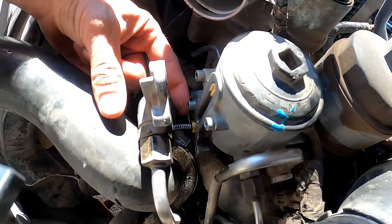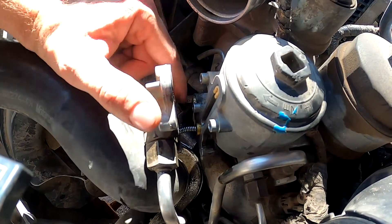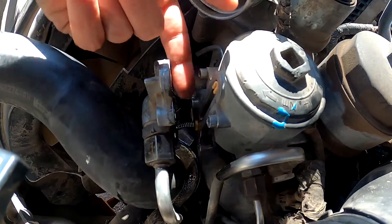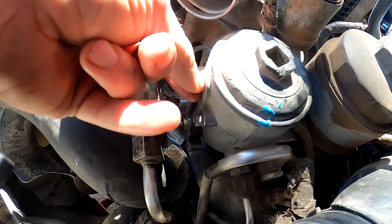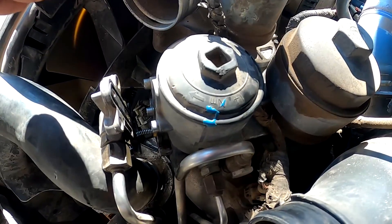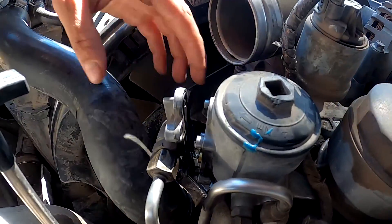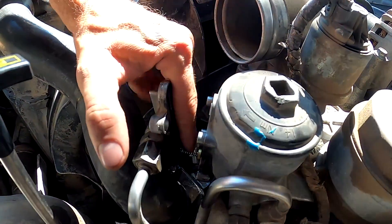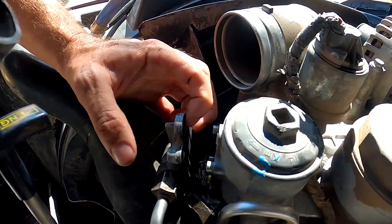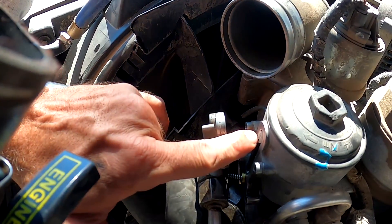I got it separated here, and if you can see right here, that's the blue spring that's under tension. Then there's this little brass piece on the end of it, like a little plunger. And then this is that little plastic piece that we need to get out, because typically whenever you're having that problem, this is your culprit. Your kit's going to come with that new blue spring, a new copper or brass plunger, and an o-ring right here where I'm rubbing my finger, and also that plastic piece with a little bitty o-ring on it as well.